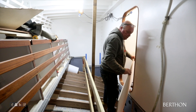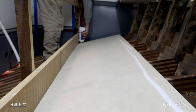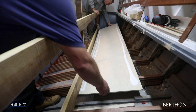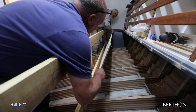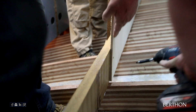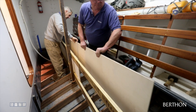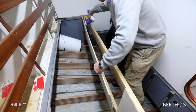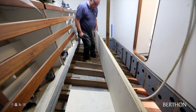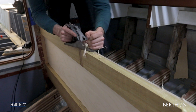The challenge here was to again get the materials through the forward hatch into each room. These were glued onto the backs of the main bench frames, wedged from below with wooden wedges in keeping with the way she had been finished throughout the entire boat, and finally screwed into place. The top was then planed off for a smooth finish, ready for the bench tops to be added.